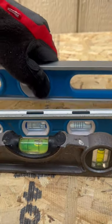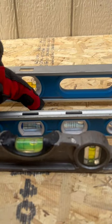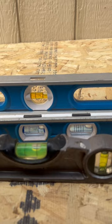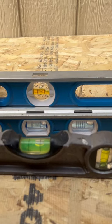Also, check the horizontal plane of the spirit level — I'm going to flip it around on the end. I made a mental note of where my writing was on my OSB board, so I'm making sure I'm lining it up at the same place. Now, look right here — the bubble is to the right. That lets me know the vial on this spirit level is good. If that bubble would have been anywhere else, it would let me know this vial was inaccurate.